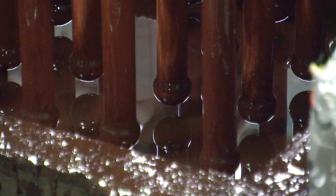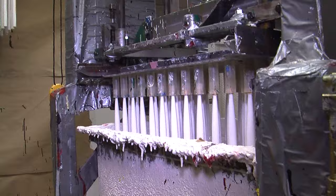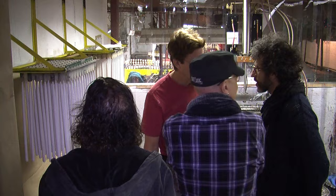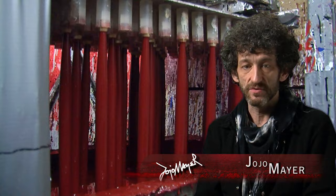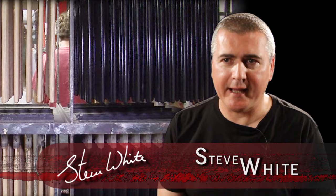The bead of the stick is put into these fixtures, and I think there's about 25 of them. But the whole stick gets dipped into the color and slowly gets pulled out, which I'm sure accounts for a perfectly situated color that has the same thickness all the way around, because it's the gravity of the earth that pulls the color down, and that is indifferent to any margins of error. Once they are dipped in the paint, they are left for hours in the drying room.